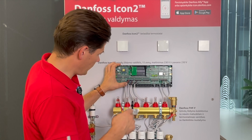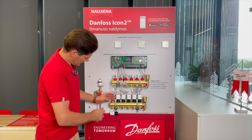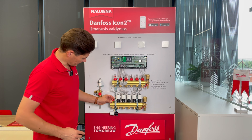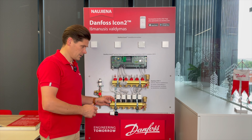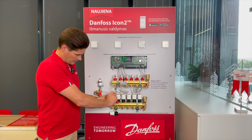This is because the manufacturer wants you to connect a single actuator per output to enable automatic balancing. There are six actuators used for automatic balancing between circuits, and those actuators can open to a needed point using PWM (pulse-width modulation) to balance heating across the entire floor heating system.